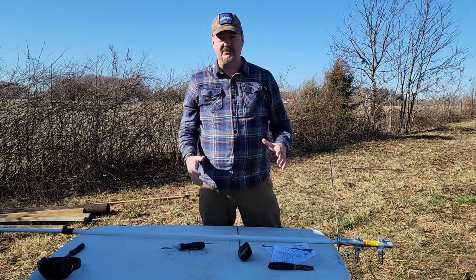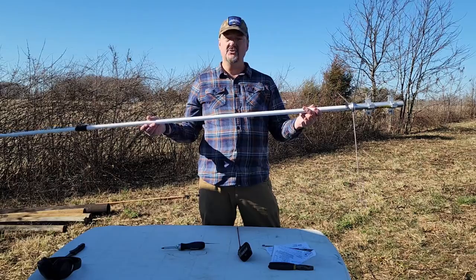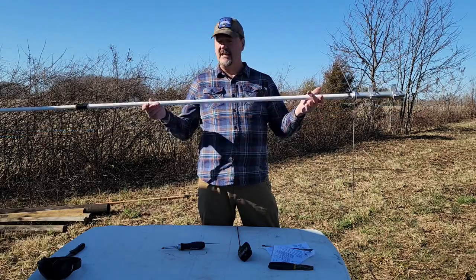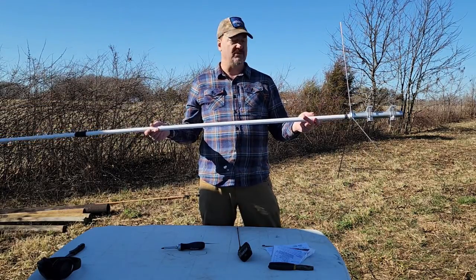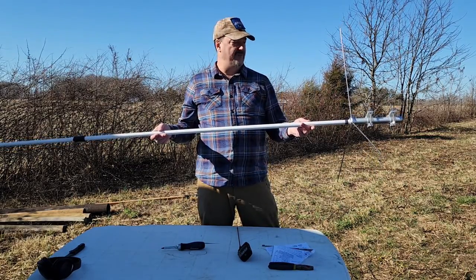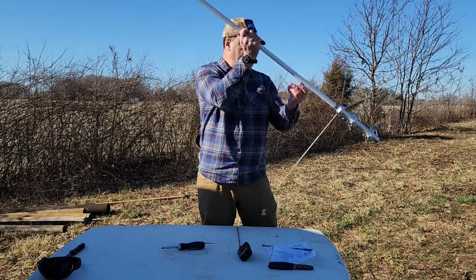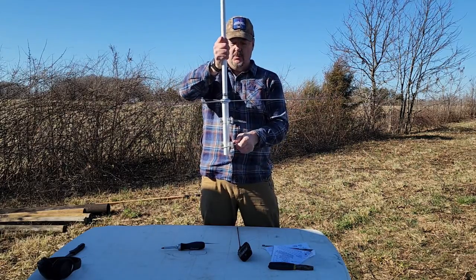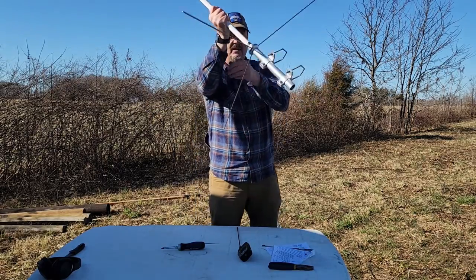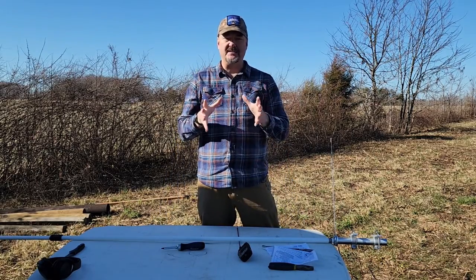And we don't have to worry about direction with this. This is omnidirectional, whereas the other two antennas, the Yagi that I'm going to try to use for simplex-based communications, and the 3-band HF antenna, they are directional. That's why we talked about a rotor in some of the other videos, and we're going to be installing a Yaesu-based rotor with a high-gain controller for turning the Yagi and the 3-band HF antenna. But this is omni, and it'll look something like this once we get it up on the tower, and then you'll see the mast coming up through here, and Ken will tighten all that down once we get to that point. Not today, though.